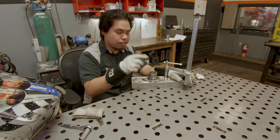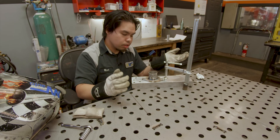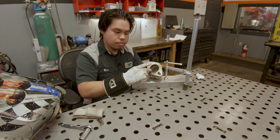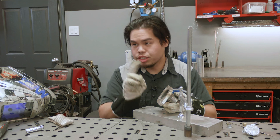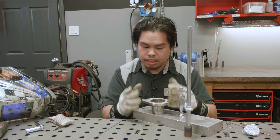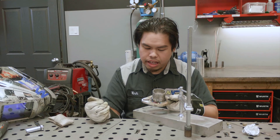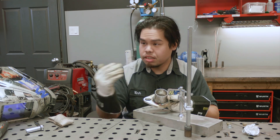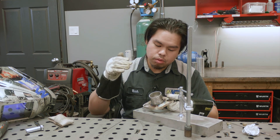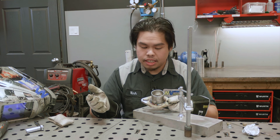It'll save yourself a lot of headache by having a heat sink and doing a lot less finishing work so you don't have any exhaust leaks when you're done. Basically, that's how to weld a flange. If you really want to weld this lip here, you can, but be advised you'll need to machine it afterwards because this flange will warp without a heat sink. Have fun with it — try different techniques, different amperages, different speeds, different filler rods. You should find something you're comfortable with and hopefully your welds will be super nice. Thanks for watching and I'll see you guys next time.